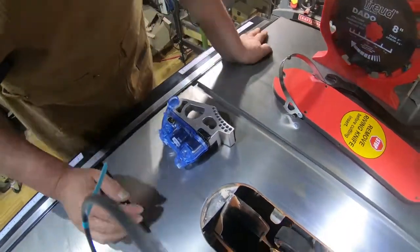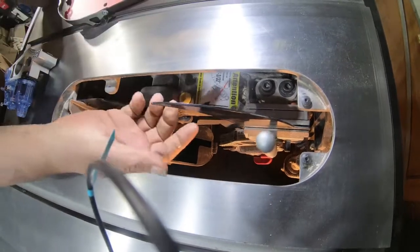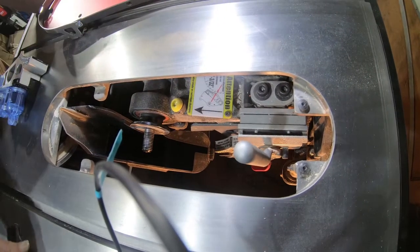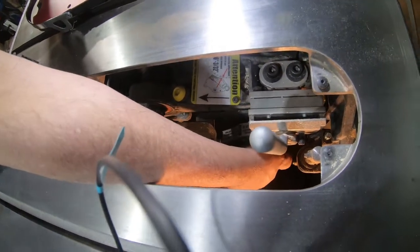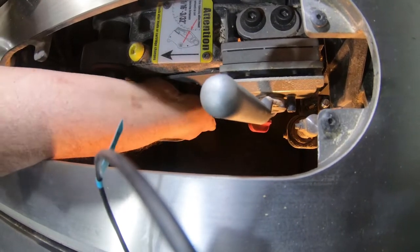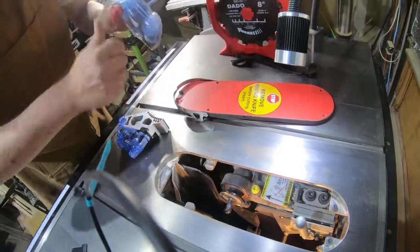The unit's unplugged. Now this is what you've got to do — it's really not that bad other than spending 100 bucks, and another 60 bucks for a blank insert. First thing: remove the riving knife. According to the instructions, if that part is not removed and you try to drive it through here, it will bend down and contact the blade, cause a trip, and you'll be out quite a bit of money. There's a little red knob right down here — twist it.